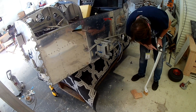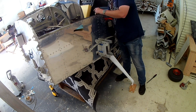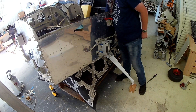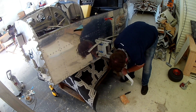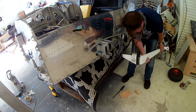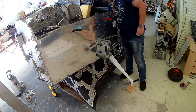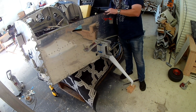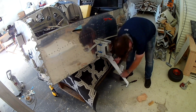That bow is what you really have to file down to make it fit. You can see me just filing over and over. Once you've got that filed in, the way you can tell is that the top of the gear leg will actually match to the top of the bracket you'll be securing it to — there's a 3/8-inch bolt hole that lines up, and until that lines up, you've got to keep filing.